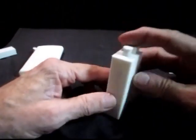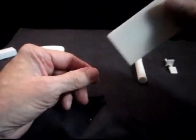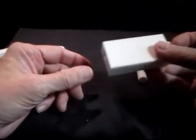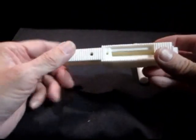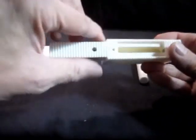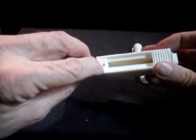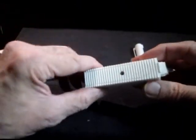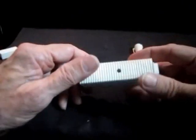You can see the bullet. This is the 3D printed bullet. Also, what this one does is, of course, we have our slide out slide, but I added a stopper so that it comes out and stops on its own, so that it doesn't just fly out. To accomplish that, I added a little set screw so that it would stop, and there's a slot machined or printed in at the bottom down there so that this rides in a slot and it will stop. And you can see there's a hole right here, that's where I put the set screw down through that hole, but when it's closed, it's hidden right there, so you don't see the hole. So that's hidden from view when the lighter is not in use as far as the Golden Gun.